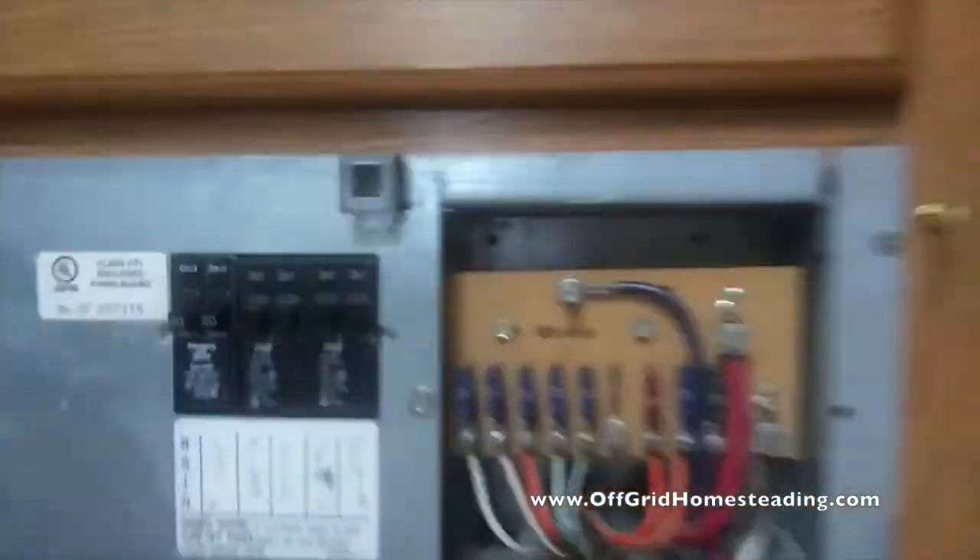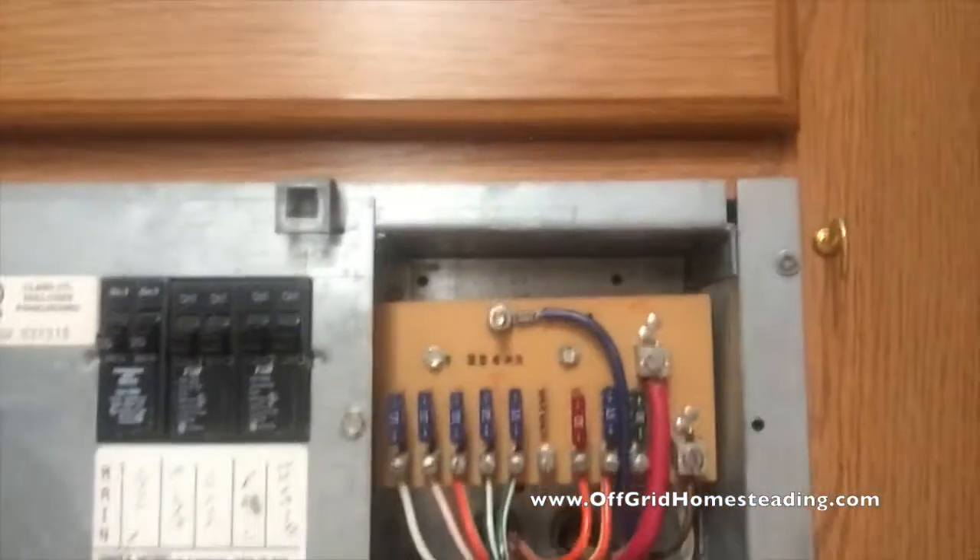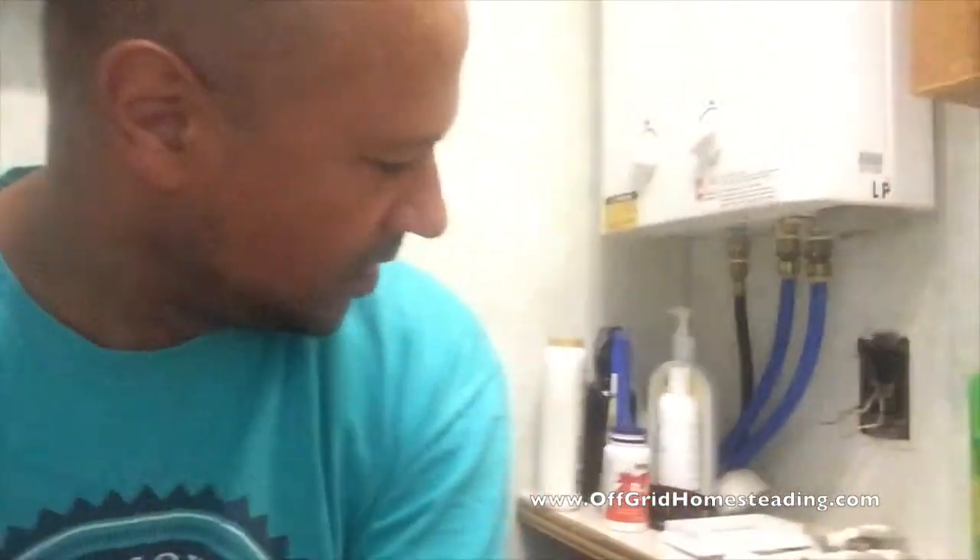I reset the inverter, turned it back on, and it was pulling something like 300 amps of DC, which means there's a short circuit somewhere. I was like, oh crap, rats probably chewed a wiring somewhere or whatever. So I had to turn off the inverter and check each of the connections one at a time, then turned all the circuits off here in the trailer, and turned everything on one at a time until it gave me that same error reading at the inverter.